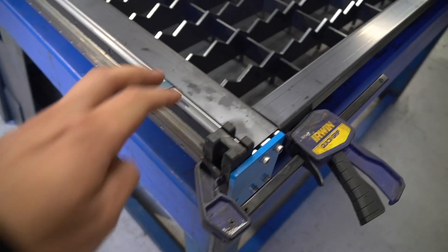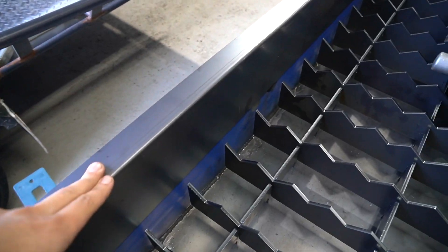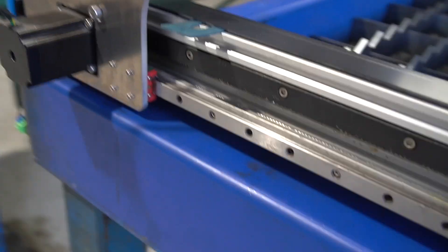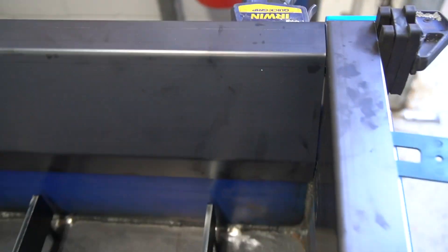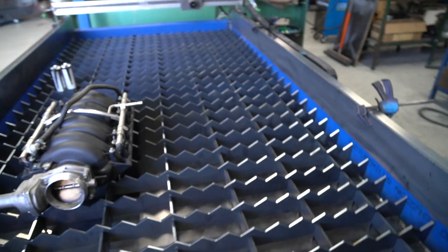Update time. I CAD'd up these splash guards and we got them lasered at a full three meter length, and then CNC folded, which is pretty impressive. These splash guards protect the aluminium extrusion where the machine actually runs up and down. And we've got end ones as well — all CAD, laser, and CNC folded. We're about to drill and tap these into the main waterbed, and then there are a few other little jobs to do before we're good to paint it.